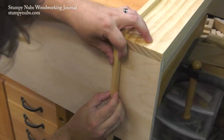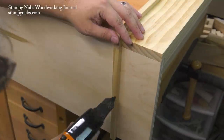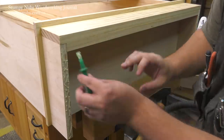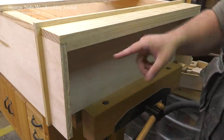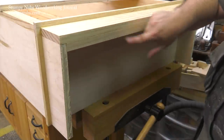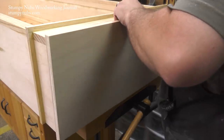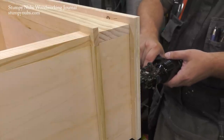Some narrow strips, which you may also find in a home center or a craft store, are attached to the edge of the bookcase to complete the wrap-around trim. Then glue is carefully applied to the top of the plywood sides — not to the edge of the removable front panel assembly, or else it won't be removable anymore. Then the top of the bookcase is attached. Note how it protrudes a bit on the sides in front, complementing the trim below it.